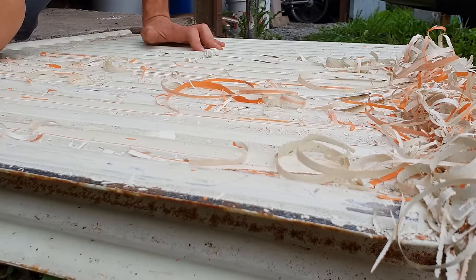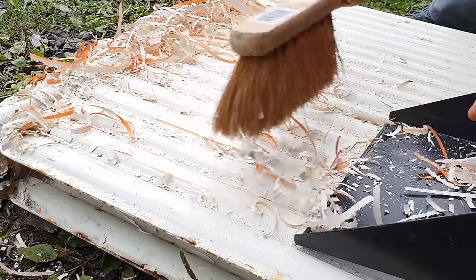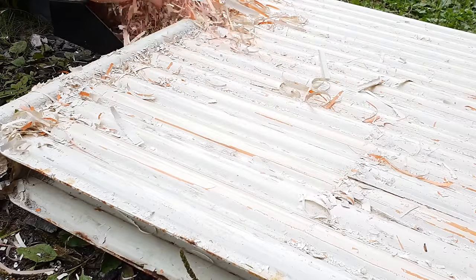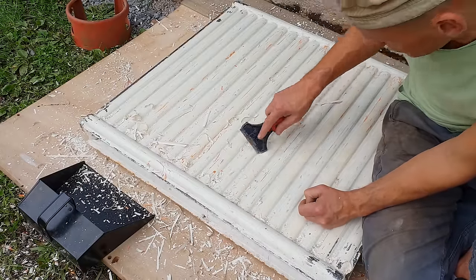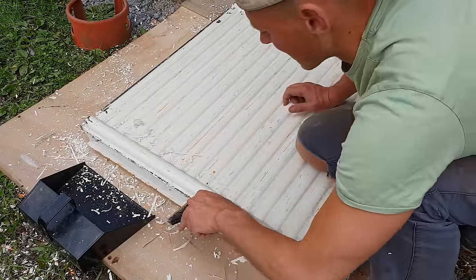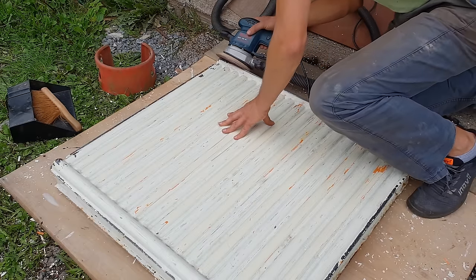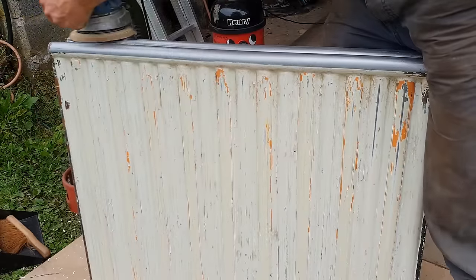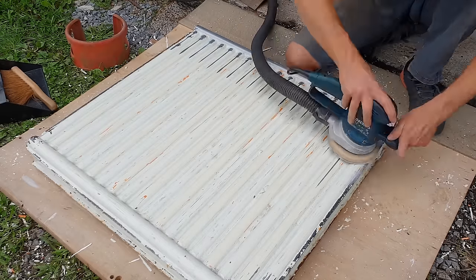The plan here with this double radiator is to have the flue gas pass between the two skins. So not actually in the pipe bits of the radiator where the central heating water once flowed. That might have seemed the obvious choice, but the volume of air that can pass through those small tubes is way too small, especially at such low pressures.